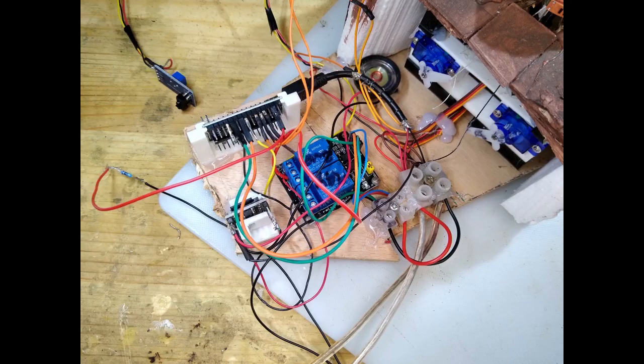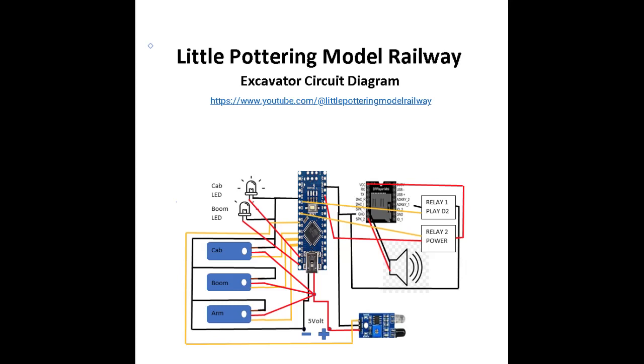The actual circuit itself, I did have a lot of problems with servo jitter after loads and loads of attempts and weeks of messing about with this, and I'm not the best coder at all. So I actually came up with a solution of controlling the DFPlayer mini using a couple of relays to sort of simulate a manual control of it. This took away the control in the code, which seemed to help the servos enormously, as you'll see from the demo. The circuit diagram itself is included with the link in the description for this video.